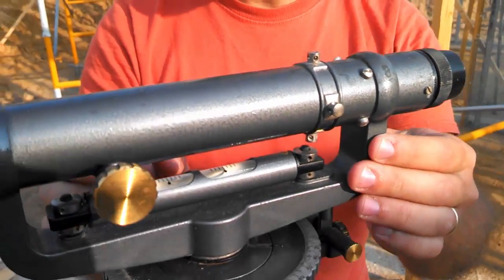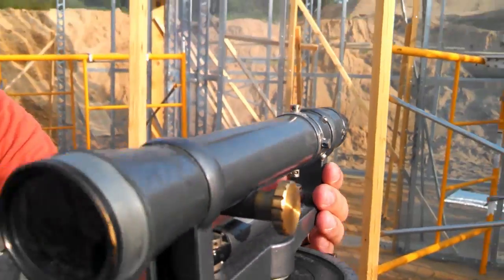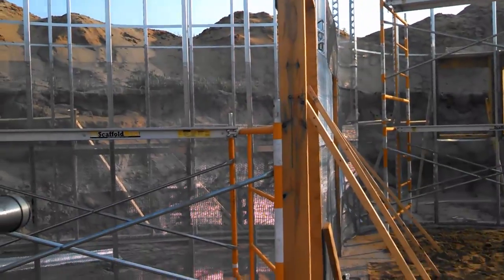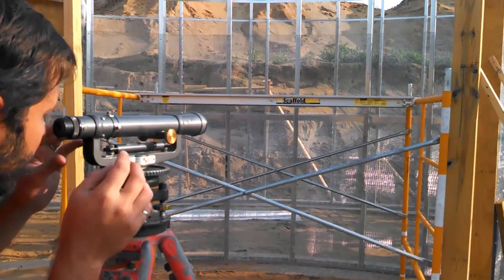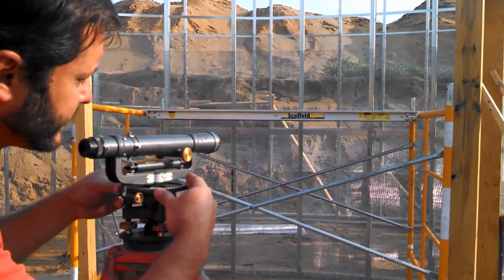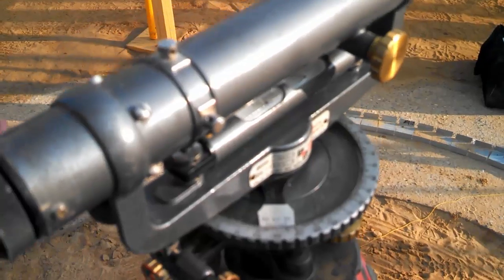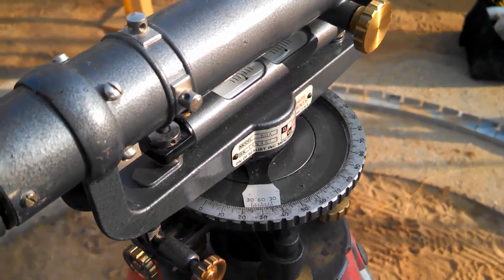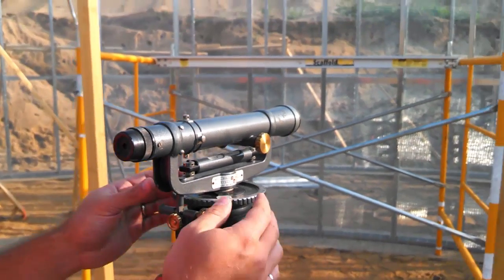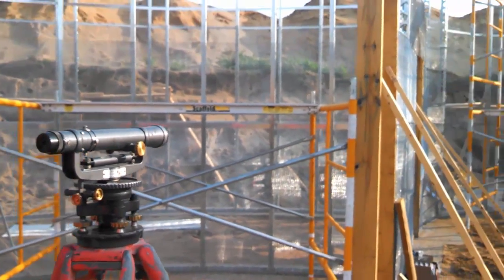Then I find my direction. In my case, I've got a direction mark which I'm defining as 30 degrees north. I look through it until I line it up with that line, then I adjust this wheel so that it reads 30 right there, and now I'm ready to go. I can pick out any direction I want to use. In my case, I'm laying out a circular room with things at very specific angles.